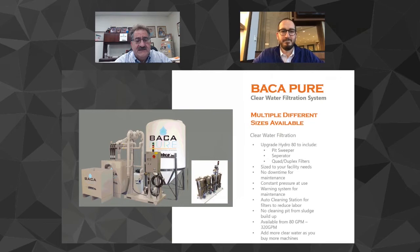When we go to the centrifugal separator, it gives us some additional water. If we want to put water into the flumes, we can do that. There's some areas where some guys will use what we call the brown water from there for just flushing. You don't need it clean. That's where, if you saw in our picture of the different liquids, how clean is clean? How clean do you need it? One of the things our system does that the pure water systems don't do, like the filter press, is we continuously make the water.